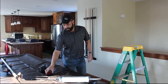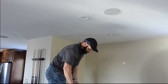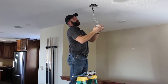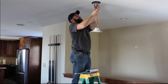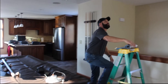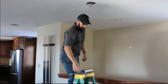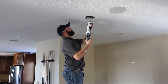Can lights are pretty easy to work with. You've got your two retainer clips right here. We're going to go ahead and unscrew the can light — obviously the switch is off. What we're looking to achieve: we've got this ring right around here where the drywallers cut out around the can light, and believe it or not, that will allow a substantial amount of air infiltration.